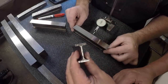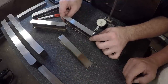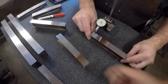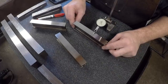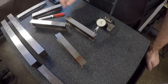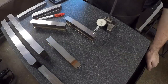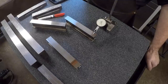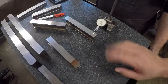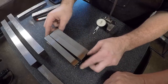I'm thinking when he mags down on it, the material is possibly moving, and they're awesome for general shop use. You're talking maybe up to 2-3 tenths variation in these things. Yeah, if we can stay in relatively the same lane, so to speak, they're really very consistent, a tenth end to end. And this is a 50 millionths indicator, one of the best tests, which will drive you crazy. But yeah, I'd be open for comment. So we're going to go ahead and call these done. These three I-beam parallels are beautiful as can be. Great finish on them. So let's just call those done.